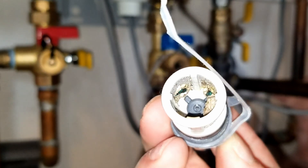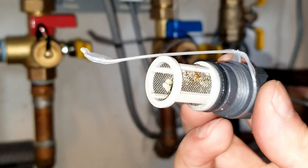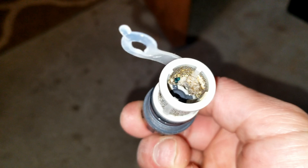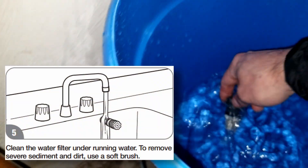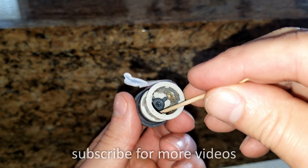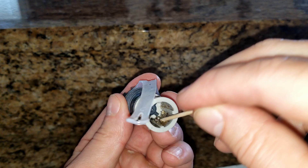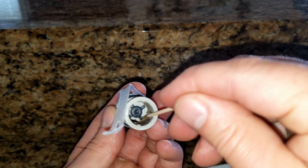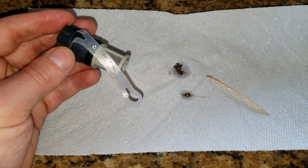Since I didn't have a new one, I'm going to clean this out. Using that same bucket the water is draining into, we're going to clean it in there. You can see how all this gunk can definitely restrict the water flow into the unit itself, so it's important we clean this as best we can. I'll use the bucket water to loosen up the debris, then use a toothpick to pick at and remove minerals, sand, and hard clay that was preventing the cold water from flowing through the filter. If it's having problems flowing through the filter, it's going to give you less pressure. I got it as clean as I possibly could.